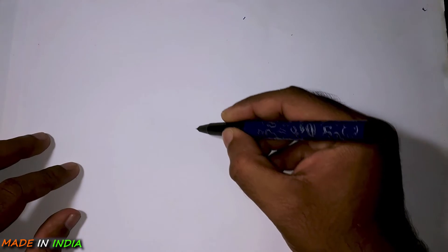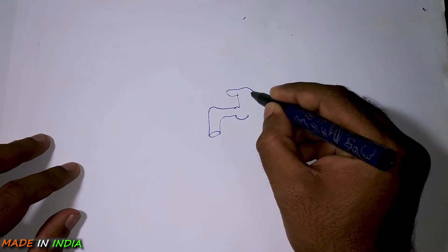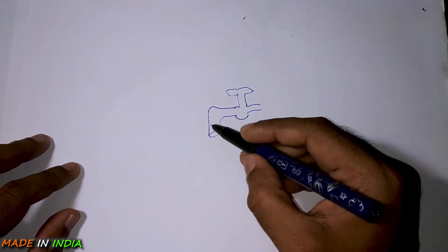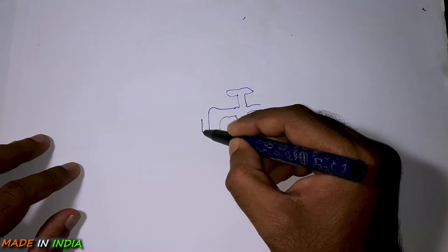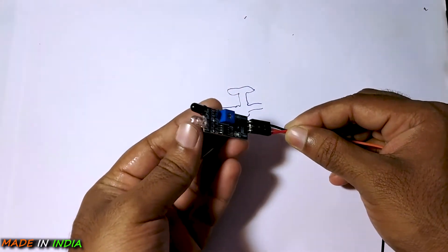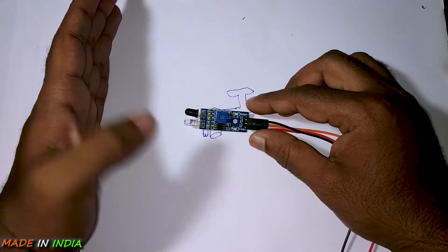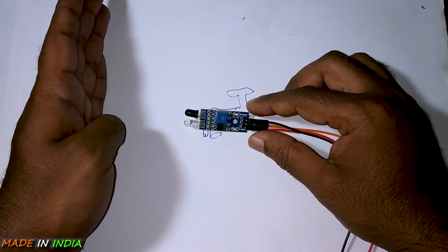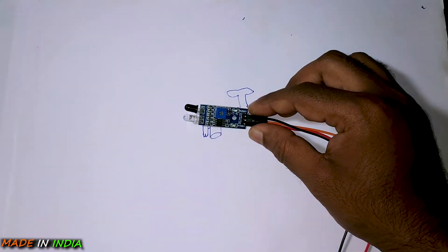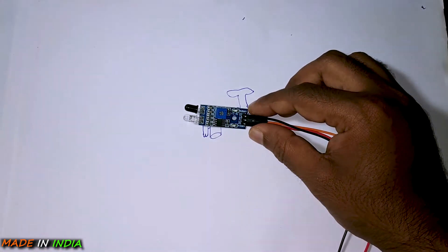Let me now explain you how this thing works. I will try to explain you this with the schematic. So here I have my tap and at the end of the tap I will place my IR sensor. An IR sensor or infrared sensor has a LED which emits infrared radiation and a receiver which receives it. Whenever you put any object in front of this sensor, the light emitted from this diode is reflected from the object and collected by the IR receiver. So this sensor basically works as a switch — whenever you put any obstacle it is in ON position, and when you remove the obstacle it is in OFF position.